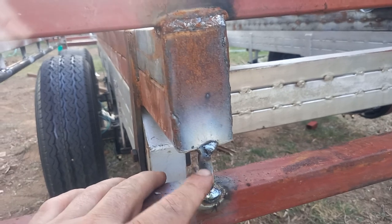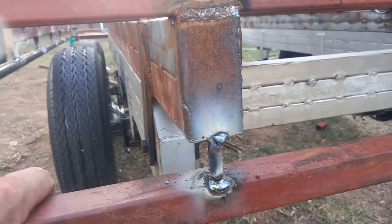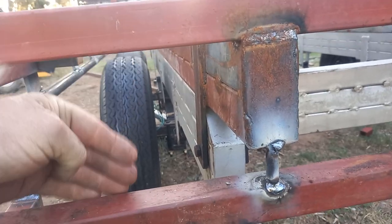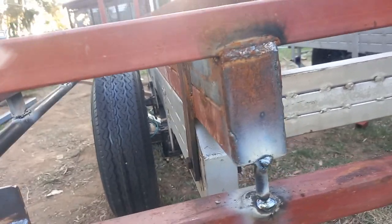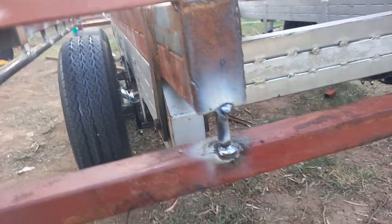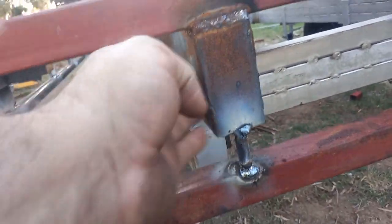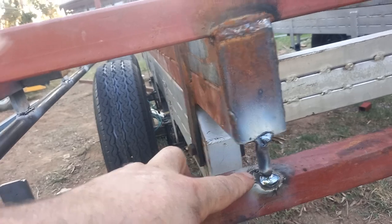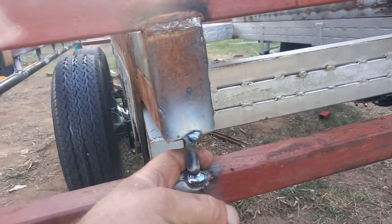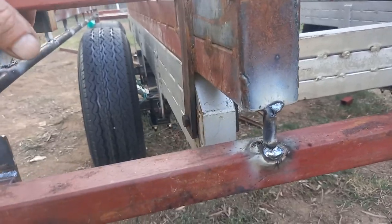What I've done is I've just welded some 12mm posts in here, and then there's going to be 2mm flat that's going to run up here so that we can actually screw stuff onto. These posts are 35mm long — because this is only 100mm — but they also act as a hook point for a strap or a rope.